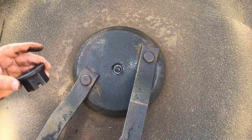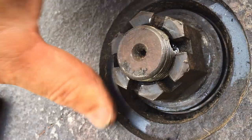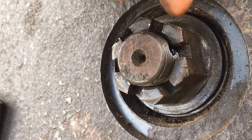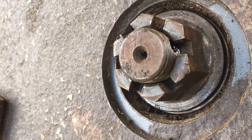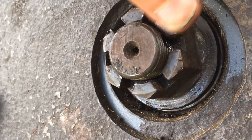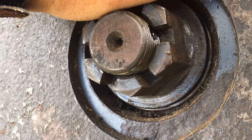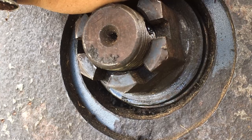I had to wind up putting a washer under it, because when I tightened it down, even if I had ground some off, the way the hole is drilled, the walls of the castle nut were too far down, too deep, and the pin just wouldn't catch on those walls. I had a washer but had to ream it out a little bit — it was big enough on the OD but not the ID — so I took a Dremel and took maybe a 32nd off, something like that, and tightened it up.